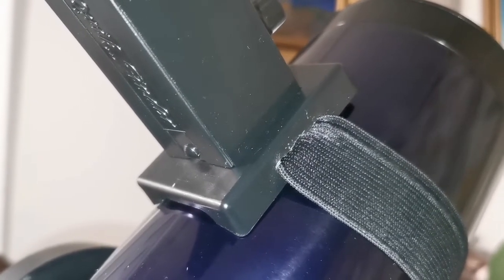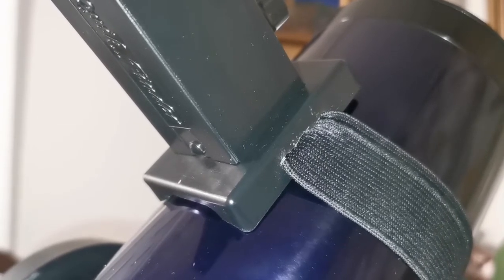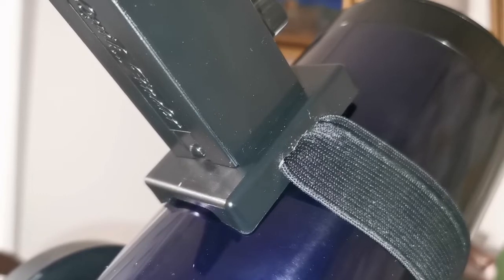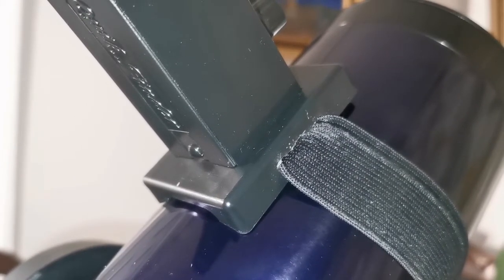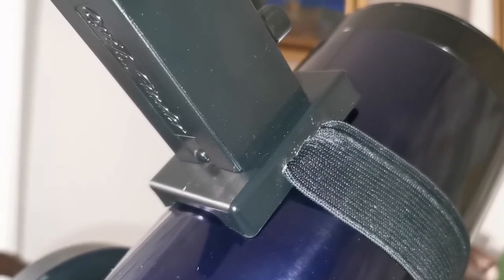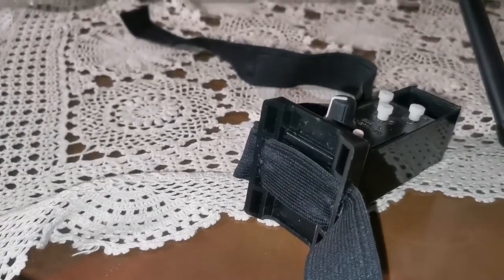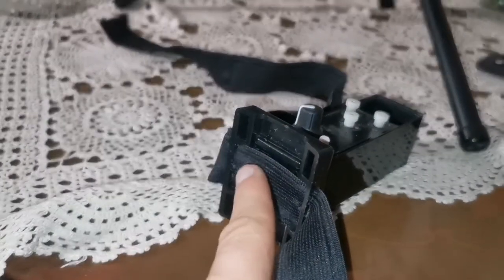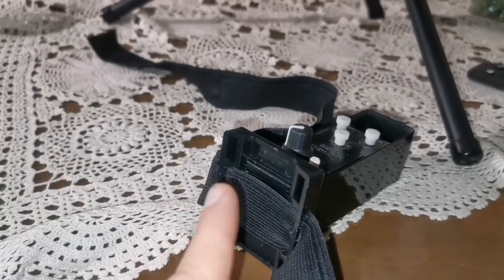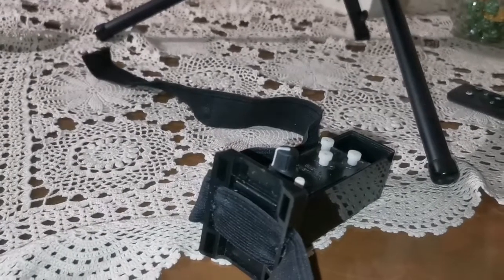To make the holes for the elastic band to pass through, I used drills. I drilled several very close small holes together, then used a bigger drill — about a two-millimeter drill — to join these holes together. Whatever I could not join, I cut with a cutter. That way I was able to make a continuous slot and pass the elastic band through it. I had to sometimes turn the drill slightly to cut the wall between the holes.